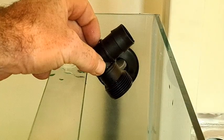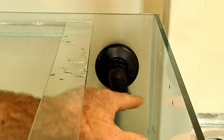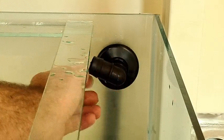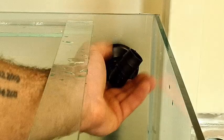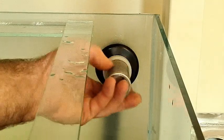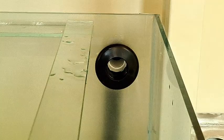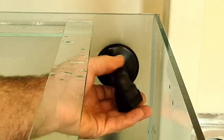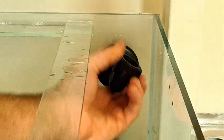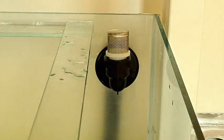I chased up the threaded bulkheads to keep my options open. This one here is just a cheap garden poly inch elbow with an inch thread — it stands up there, really unobtrusive, and the further I turn it around the lower the tank level will be. Simple, doesn't get any easier. Another option is I can just screw a screen straight into it — the water level will keep fairly low but it keeps our options open for different things we want to keep. Another example is just a bush and a poly elbow screwed in, then screw a screen into the top of that. It's just whatever you want to do — easy.